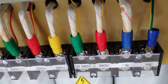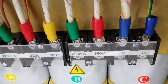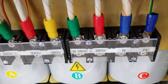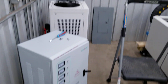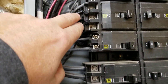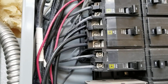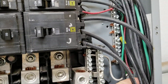The real question is, what is N and PE? The PE looks like ground — you can see it's a small green wire, so I'm guessing that's ground. And N, I guess, is a neutral, but I don't have a neutral on my three-phase. On single phase there's obviously a neutral bus, but this is a normal three-phase breaker right here — you can see I've got three hot leads coming out of that.